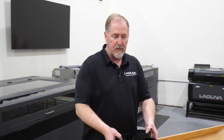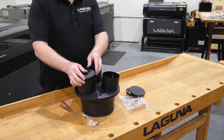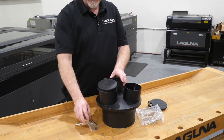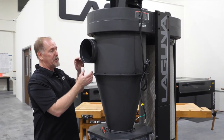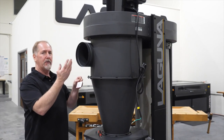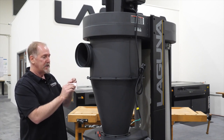The C-Flux 2 and the C-Flux 3 both have an 8-inch inlet port on the machine. We provide a splitter so that you can install 4-inch diameter hoses. There are two rubber caps that can seal off unused hoses while you've got one connected to another machine. Locate those in the intake splitter bag along with the three screws used to attach this to the machine — that's done with a Phillips head screwdriver. The intake splitter will be installed on the inlet of the machine. There's a small tag that gives instructions for adding bleed air: if you've got restricted flow coming in, there won't be enough air flow to separate your materials or activate the cyclone or cool the machine. Remove the tag and install the splitter — look for the slotted holes in the edge of the intake splitter, slide it over to match up with the corresponding holes on the inlet tube, and install three sheet metal screws.